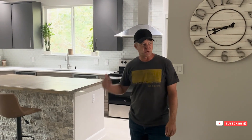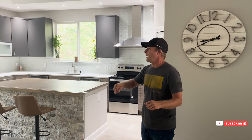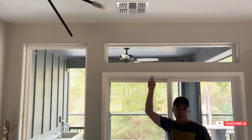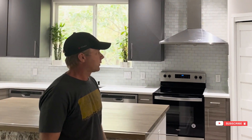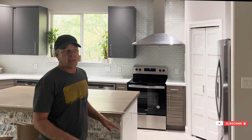That kind of wraps up my explanation of balanced ventilation and this demonstration of how a house actually depressurizes. Before I go, I want to tell you where we're at now with this house and what we're about to do. I had my current crew, who does know what they're doing, come replace the makeup air — it was only a six-inch, which wouldn't have been big enough, so they replaced it with a 10-inch and the whole thing is all set. They couldn't run the wire to the range hood because the attic space is super tight, so that's why I'm here now — we're about to figure out how to get that wire from the damper to the range hood through the attic. Once I do that, we'll be done, and this will actually work properly for the next owner. We'll see you next time on Scotch Rebuildings.